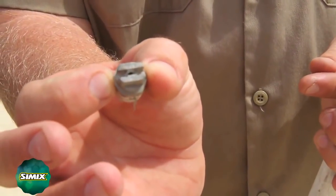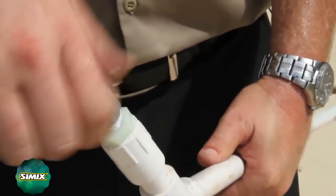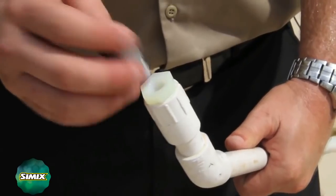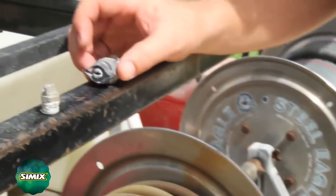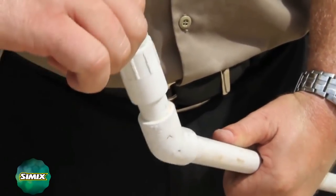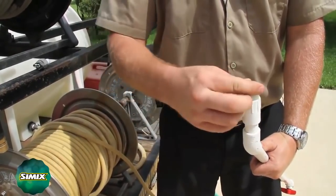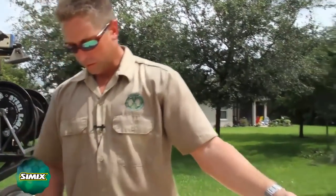You're also going to get very good results using this tip for Oxy-1 applications — it's 65 degrees at four gallons a minute. For Oxy-Seal asphalt shingle sealer or the concrete application through your SureFlow hose, you would use this. What you would do is basically take this off, unscrew this whole piece. This would be for your proprietary roof treatment for three-year warranties and Oxy-1 cleaners. Basically, you've got the Teflon tape on it — hand tighten because you're working with a little bit of plastic. If you tighten it too much, you're going to split your plastic and it's going to drip, and the next thing you know you've got white spots all over the roof from too much asphalt shingle sealer. So that is your application tip for your Oxy-Seal.